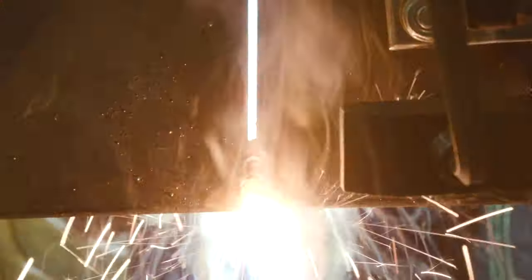First I'm going to light up on the tack down here, get that burnt in, and then start a little whip-and-pause, advancing ahead and dropping back down. You'll notice I don't have as much punch as I should, mostly because of the improper bevel angle and the excessive land. Typically I would run a smaller land and a wider bevel. You can see how the filler metal is kind of bunching up in the center of the joint — I'm probably not getting good penetration to the backside, although I can hear some faint penetration on the back.